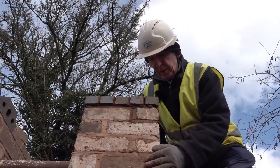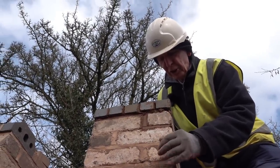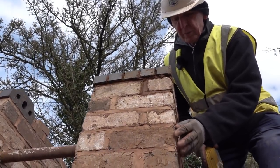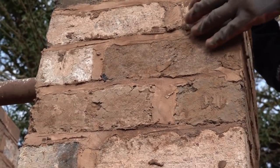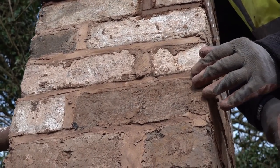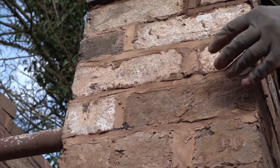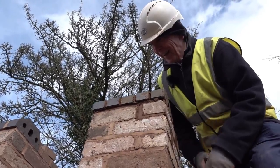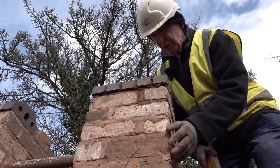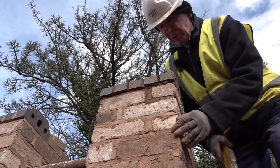You know, say in a pub you've got like the plaster on the wall and they make it rough so it looks heritage. And it's the same with the brickwork when you go into pubs — you can see some of the brickwork is all over the place. With these different bricks you have to sort of work from bump to bump to make it look anywhere near. It was a challenge because you can't really build it bang on square and upright with reclaimed all-shapes, sizes of bricks.